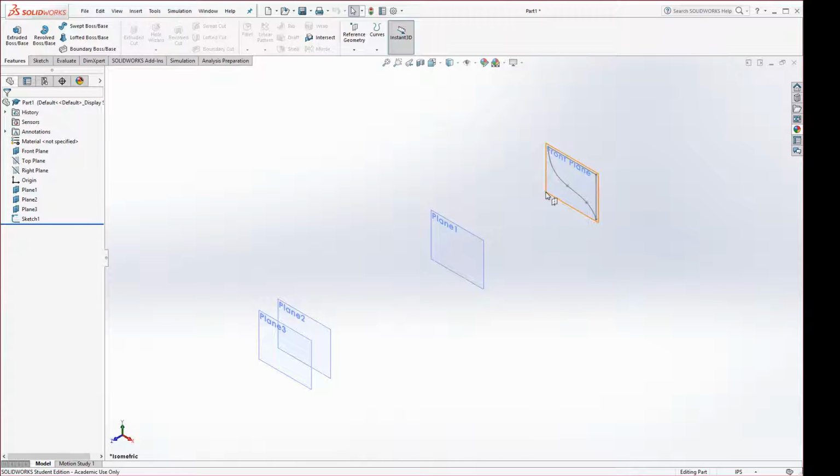We'll do one at a time. Now, what you don't want to do when you're copying a sketch, or let's say you want an entire sketch with the dimensions to carry over, you actually want to select it from the feature tree and Control-C or go to Edit Copy and then paste it. Do not do this. Don't just select individual entities and then assume that it's going to grab the whole thing, because it will not. It will just select that individual entity. Other things like dimensions might be left behind or other geometry.